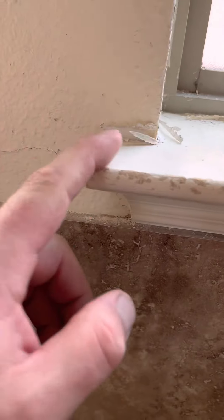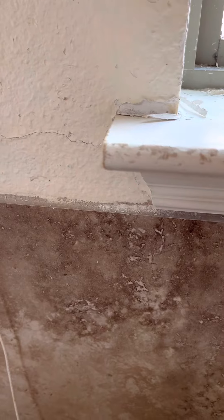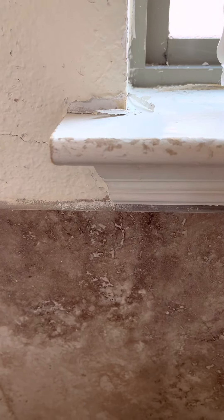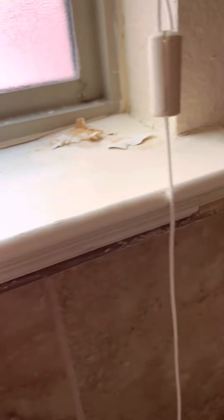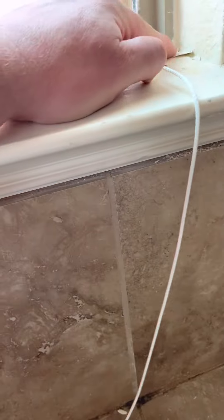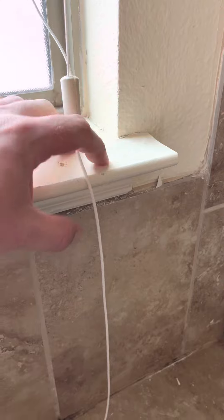Our problem here is they've cut this so tight to the drywall that it's actually taking the texture with it — that's not good. Even if I go in through here with an oscillating tool, it's still going to jack up the texture. So I let the homeowner know we need a little more repair work. The good part is it was a tight fit over there, over here — not bad. There's quite a gap over here, so we're going to tidy that up to get a nice even gap. This is serviceable since it is over a bath.